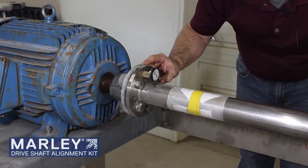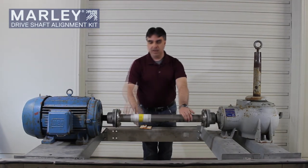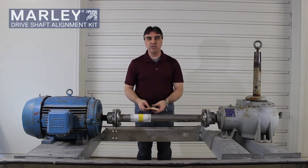Come back to 12 o'clock and our indicator is reading zero as it should. So the driveshaft assembly is dynamically balanced at our plant and then it is packaged up and shipped out in its crate. Taped to the tube and flange is a copy of the driveshaft alignment instructions. So now we've taken our measurements on both ends and we know it's out of alignment.